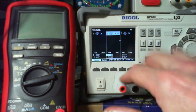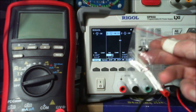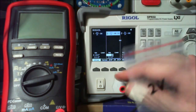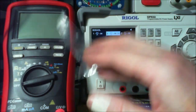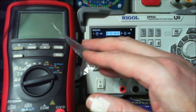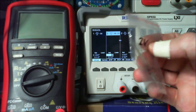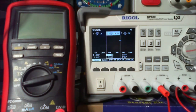When it's just the one side, when we're just going up to 30 volts, we'll just use one of the channels. You know, keep things simple. And of course, 2 volts up to 30 volts, one channel, and then when we bring in the two channels to go above 30 volts, we'll use this meter as well, just to give an indication of the one voltage, not split across two, like that. Okay, let's get it going.